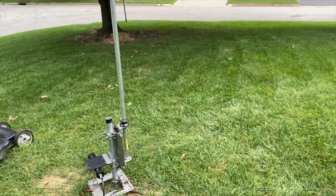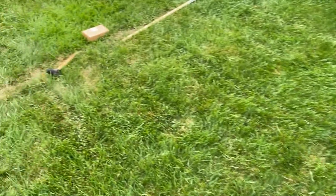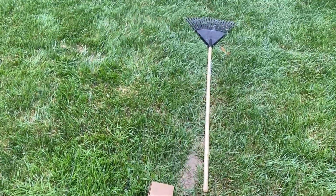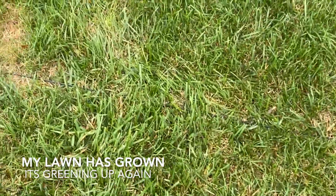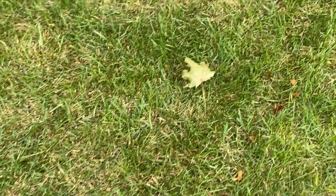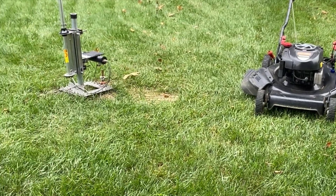Here it is August, about two weeks after I've laid down the field, and I've cut my grass. I found one wire that's a little proud - that's going to be pushed down, and there's also another one right here. I had to make sure I lifted the lawn mower there. Next door they're doing a roofing job, sorry for the noise. I didn't have any problem - didn't snag a single wire. There are radials down here - you can barely spot one. Only where the grass was shy can you see it. There are a few spots I have to put down staples.